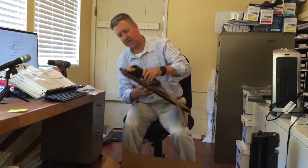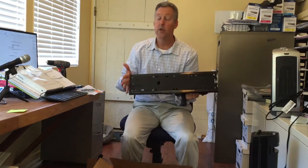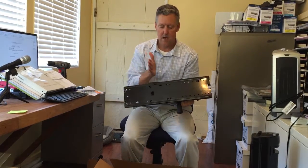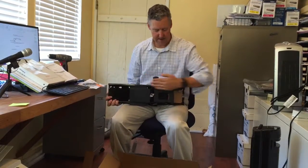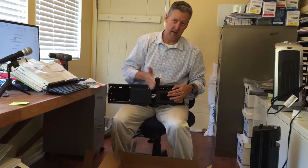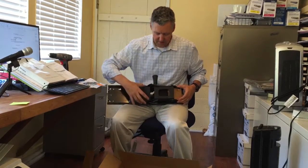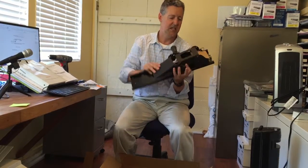Here's the track — this is 22 inches. They also make a 17-inch track, and they can be cut to order so you can make them shorter. This attaches to the underside of the desk. You want to make sure you have 22 inches of free space underneath so the arm can slide back and forth and fully retract. This piece here is the arm — it goes up and down and changes the angle.